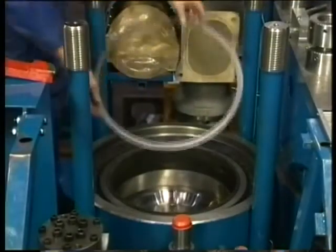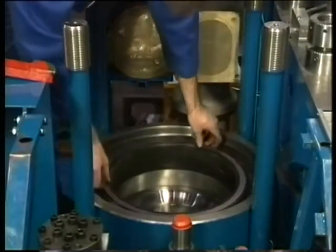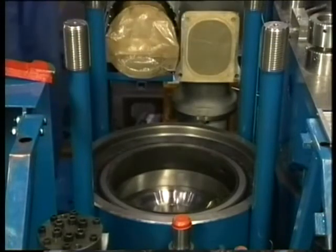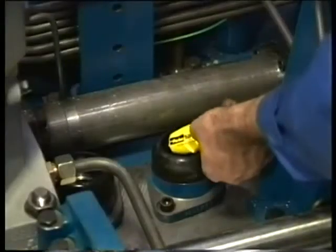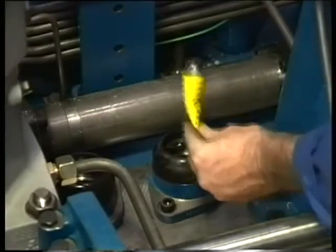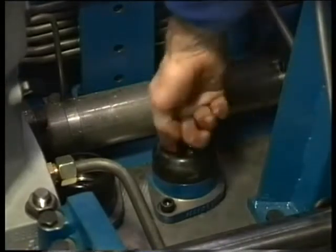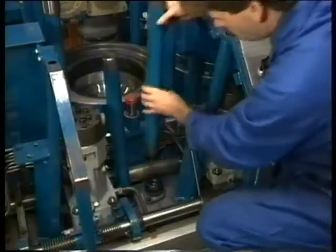When mounting a cylinder head, always use a new steel gas sealing ring. The gas sealing faces of both the cylinder liner and the cylinder head must be in good condition. Otherwise lap them slightly with a lapping ring. Clean the push rod sealing rings thoroughly and grease them with the required silicone grease, which keeps the rubber in good condition. Subsequently place the push rod protecting pipes.